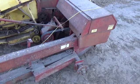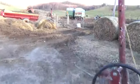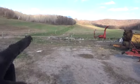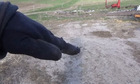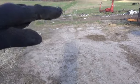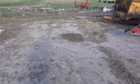One of these days I've got to get that wagon dug out and swap these tires around and then get this chopper put back away. That's what's going on with that, and it accomplished what I wanted it to. See, out here I planted these two fields. The drill sits tipped down like this so the back is higher, and what's happening is it's letting the front of the drills dig into the ground too far — it's really too aggressive. So by leveling it out more, the back gauging wheels, or press wheels, hit the ground sooner so it's not too aggressive. That was my goal with that.